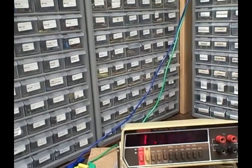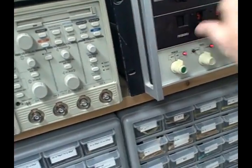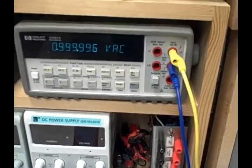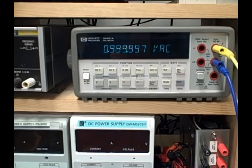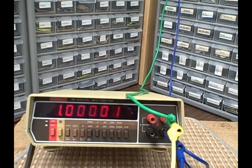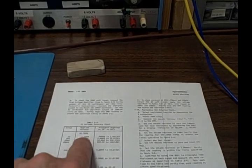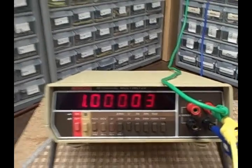At this point, let's take a look at the AC signal. All right, we connected to this Fluke 5200A AC calibrator. I have to change my frequency to 1 kilohertz, okay. That's about as close as I'm going to get it. Looks like I've got 5 nines to 1 with 5 zeros, and my result is 1 and 5 zeros. I think it's right there. So we needed between 0.99868 to 1.00132, and we are right on the money, so no problem with that.